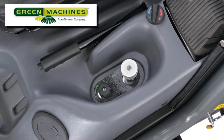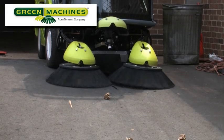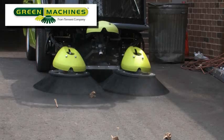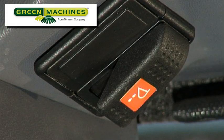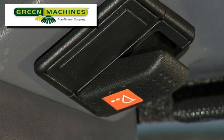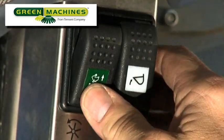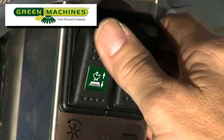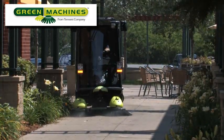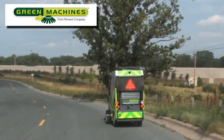There is a brush down pressure adjustment knob in the cab next to the water flow control valve. By adjusting the down pressure on the brushes, you can place one brush onto a step or curb to sweep debris into the suction path. There is a flap on the suction head that aids in lifting light litter from the surface; this flap makes a chopping sound which can be adjusted by changing the vacuum power. If you are sweeping in the rain or there is a lot of standing water around, activate the hopper drain switch above the transit work switch so water can escape from the hopper automatically. If you need to move to a different location a short distance away, select work mode 2 — the brushes and suction head will raise but the wheels will remain tracked in. When you arrive at the next location, simply return to work mode 1 and the sweeping systems will resume with the same settings. If you have a long distance to travel, select the transit mode; the front axle will track out and allow higher speed travel.